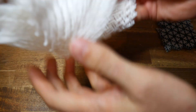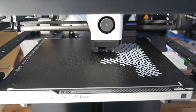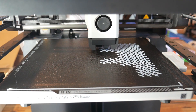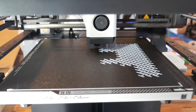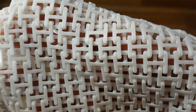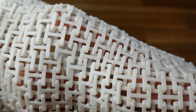It's also quite large, which makes it more tactile. When you're printing chainmail, you need to have an absolutely spot-on first layer. For this model, there's over 300 little segments, and if any of them peel off later on, there's a good chance they'll keep dislodging more segments, knocking them off like dominoes. The other thing that needs to be completely spot-on are your retractions. If you get that wrong, in-between all of these segments will become a stringy mess.